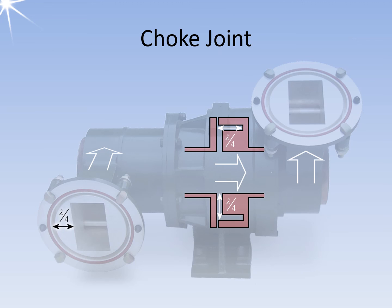The stationary and rotating sections of the round waveguide have no direct electrical contact. This waveguide connection is called a choke joint. The choke joint provides good electromagnetic continuity between sections of the waveguide with very little power loss. Due to the two lambda-quarter long slots, the short circuit at the end of the horizontal slot is first transformed into an ideally infinitely high impedance and then into a short circuit again after the next lambda-quarter long slot.